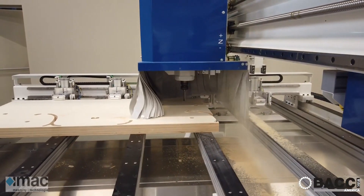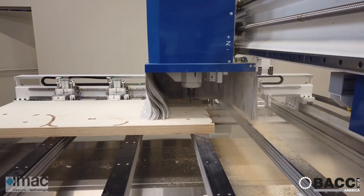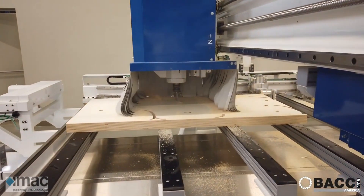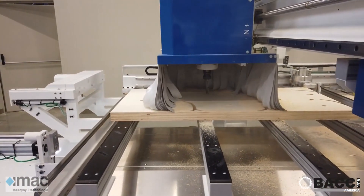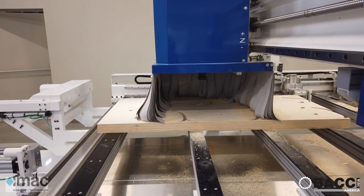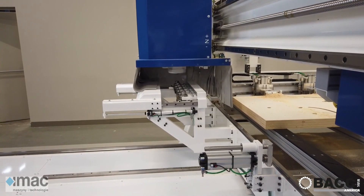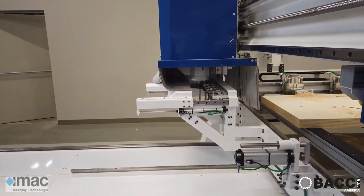The tool magazine has six positions. These are bars — the bars are adjustable — and even the clamps are adjustable in position. As you will now see, we will start the cycle: the clamps and bars will be automatically adjusted by the machine according to the positions set in the program. On this program we already have some bars in position, and the machine is going to set up only the bars and clamps that are required to be repositioned.